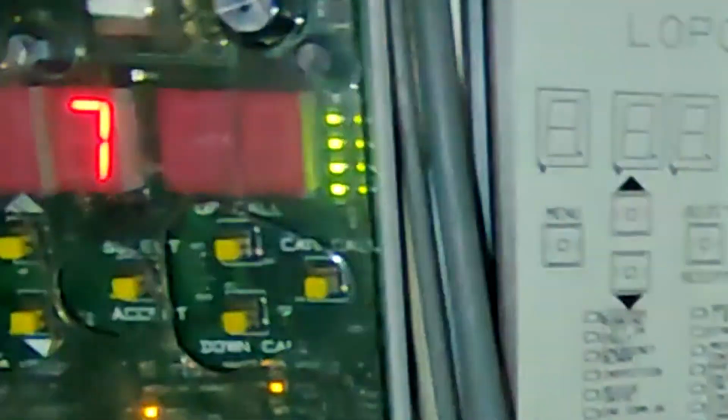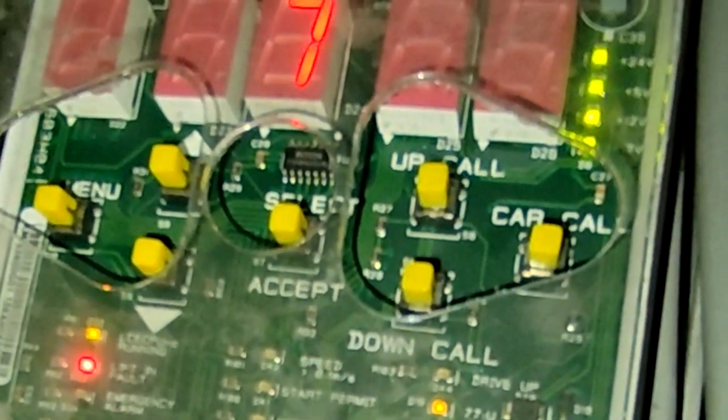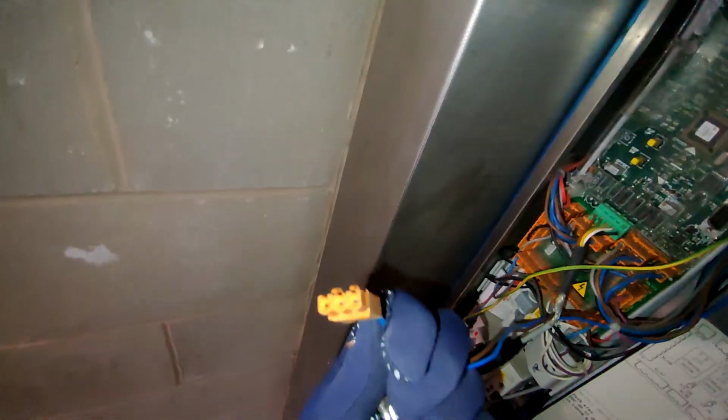So, on Ecodiscs, on the red light for fault, this light also comes on for fault 21. Fault 21 is safety or normal is not present, meaning if you have the lift on inspection, on Ecodiscs this actually counts as a fault, which can be a bit deceiving when you're actually looking for a real fault. But when I try and drive the lift, the red light goes out, indicating there isn't a secondary fault on this lift. That's why that's not running, that's out.